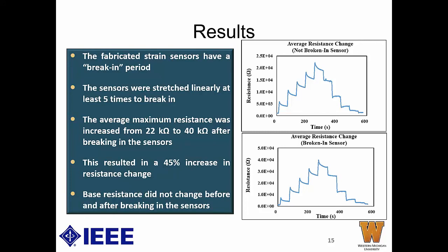I had a last question actually connected to the one of Vincenzo. I mean, you're saying by laser you're actually carbonizing, but do you really know what happens there? I mean, carbon is a very general concept. What are you actually getting there? Is it graphitization, amorphous carbon? Because, you know, the conductivity changes a lot according to what you actually form there. But like I said, this is a very new device to us, so what we would definitely look into.